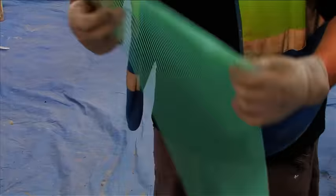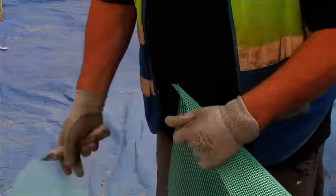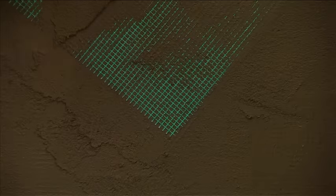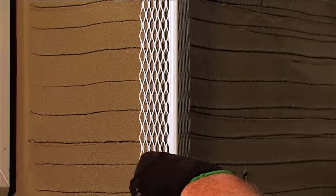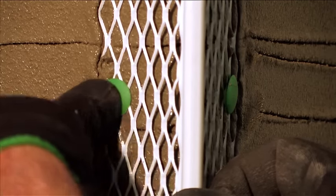Ensure mesh is wrapped around the external corners. Any offcuts should be resized to 200 by 200 millimetre patches and used as additional stress patches for corner reinforcements. These should be bedded in at 45 degrees to all window and door openings to prevent hairline cracking. Lightly scratch the base coat surface with a scratch comb to provide a suitable key for the dashing water. Any profiles and base rail should be cleaned to remove any traces of scrim adhesive. Install powder-coated, galvanized or stainless steel corner beads using the appropriate fixings.